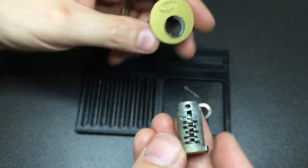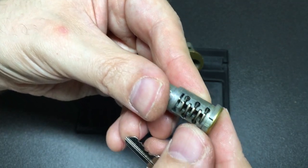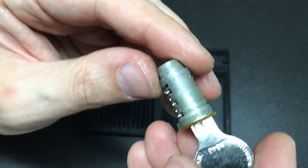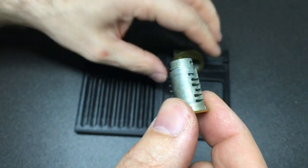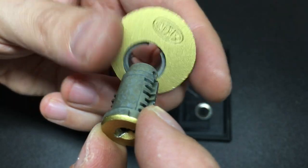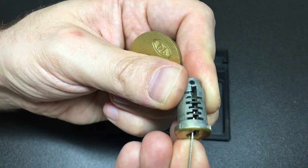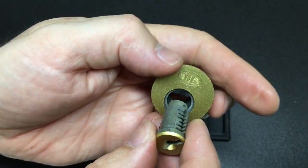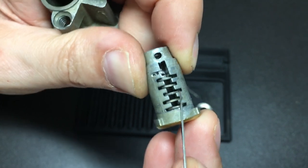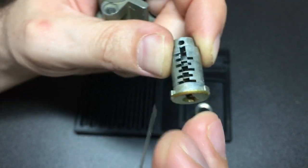Let's get the key so you can see what happens when you put the key in. You've got these little wafers here — there were five of them, yep — and they spring down, and then you put the key in and push them up. They're in this sprung-down position and engage with the cutout on the bottom, so it's all locked in like that and can't turn. The top position is such that if you over-picked one of the wafers — if you picked it too far up — it will go into the top and possibly bind there, over-lifting the wafer and stopping it from opening. But the tolerances in these wafer locks are usually so poor, there's lots of movement, and as you can see, it doesn't take very much to open.